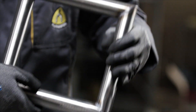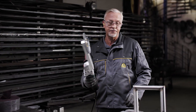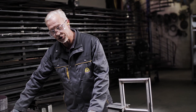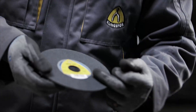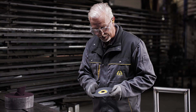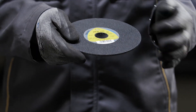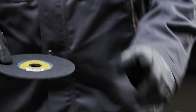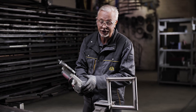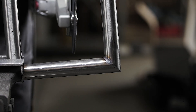For the inside part, I need a different tool — this is the fillet weld grinder. Again, using a nylon web product, we have the same principle here with the maximum RPM and the optimal RPM. You can slow the grinders down on both machines to achieve the optimum speed. This particular one is a medium grade, but these come in coarse or very fine materials as well. This is a good all-rounder.